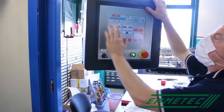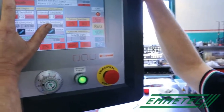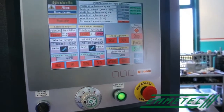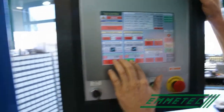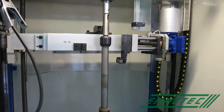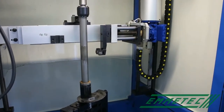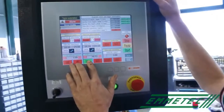On the screen of the mangusta you have to adjust the position of the blade, the rotation speed of the shock absorber, and the penetration of the blade. The first time must be done manually, but then it can be memorized and used on the same type of shock absorber as many times as you want.